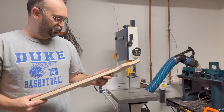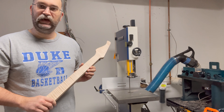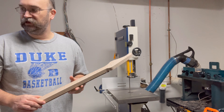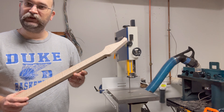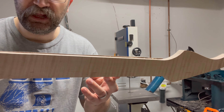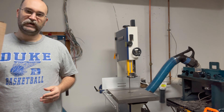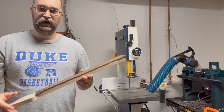I'm definitely happy that I used the bandsaw here. I was surprised — it's a new, really high quality blade, and it seemed to be having some issues cutting through smoothly. It's nothing that can't be fixed with the belt sander, and I'm not sure the router would have done a good job either. Luckily I've avoided tear-out by doing this. You can see I'm much closer now to the neck blank. Now I'll go to the belt sander to smooth this up and see what other work remains.